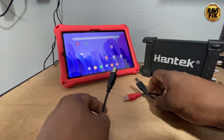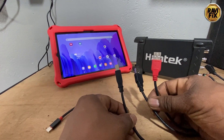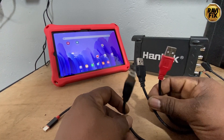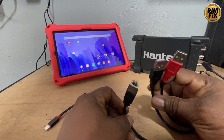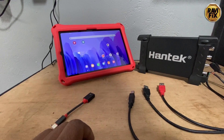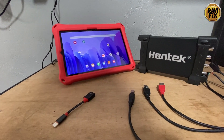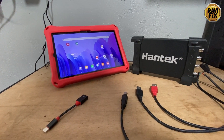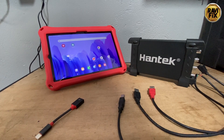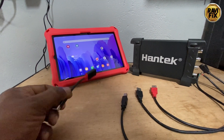Hope you have this Y-cable that you got with the oscilloscope when you bought it. I'm going to demonstrate how to avoid this battery drain problem with a small modification to this cable. You may know this red USB-A connector is provided to charge the host device battery while using the oscilloscope, but it's not a solution to our problem because it does not charge as fast as it drains the battery. Also, this cable does not power the oscilloscope directly — the oscilloscope always draws current from the host device.